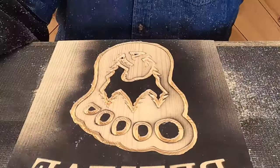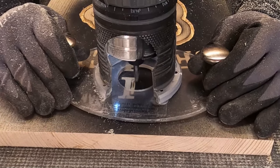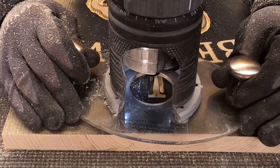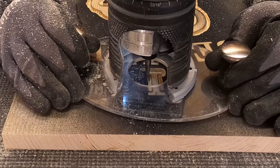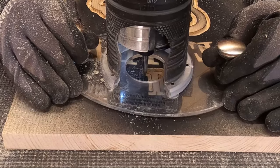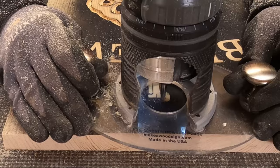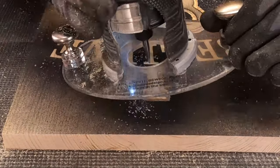Now Dad mentioned that we're carving this with vertical grain as opposed to it going horizontal. One of the things that's hard to do on that is if you hit a piece of hard grain and you're carving vertically along it, then you have to try to keep that line straight even though the grain is going crooked. So the grain could be going all over the place, but you have to try to keep the line straight. It can get really difficult depending on the board.